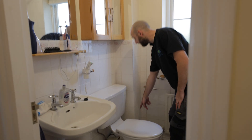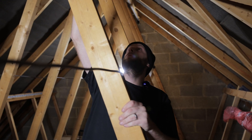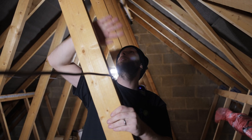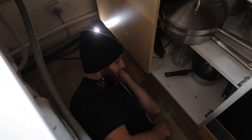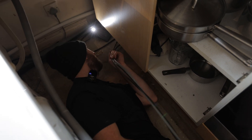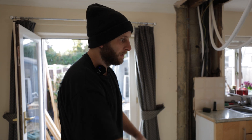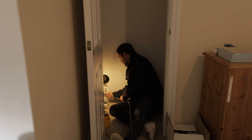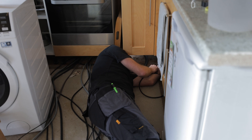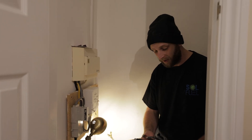Below here is that box in. We've poked up here, all the way through, which then takes up into the loft, allowing us to get to our panels and the cylinder. We've got a solar cable up here with a little bit of slack so we can tighten it all nicely. We'll clip up the rafters - it pokes over the lap so we're not penetrating or ripping the membrane, which is quite important. So we're going over it and Alex is the other side to grab the end. Cables are now down from where they need to be, and we've run them round and poked them through the wall to get to where the consumer unit is. That's the bulk of stage two done - cable routes are in from A to B.